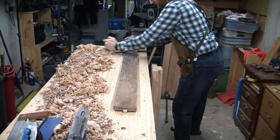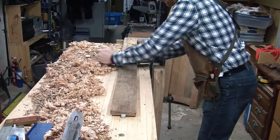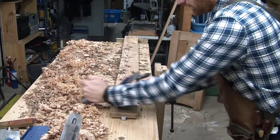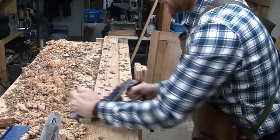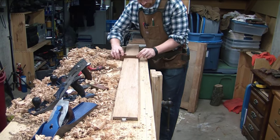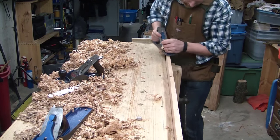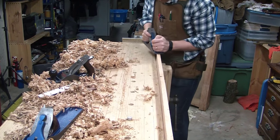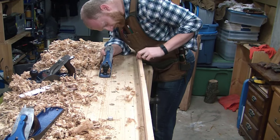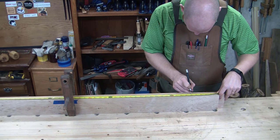To start off this step in the dresser, just like every other step, we need to dimension the boards. We start with rough planing and smooth planing to get two surfaces nice and smooth, and that allows us to mark off the actual dimensions. Here I'm placing a mark from one end to the other exactly four inches away from one side, then I can smooth it right down to that line and end up with a board that is three-quarter by four inches.